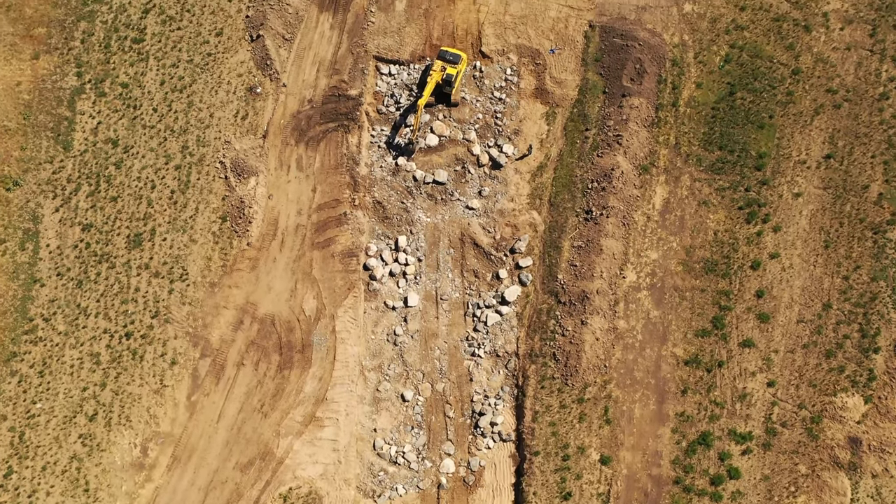Proportions of the different materials are specified in loader bucket units. Keep in mind that the proportions shown in the specs were developed with the goal of filling the voids of the riprap without displacing any of the riprap pieces, so the size of the initial riprap pile should not significantly grow as additional materials are added. We recommend an initial test batch be mixed with the inspector and engineer present to allow visual observation of the various VFR ingredients, batch proportions, and mixing operations.